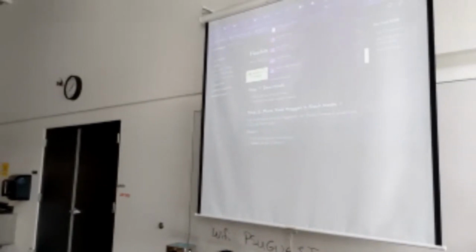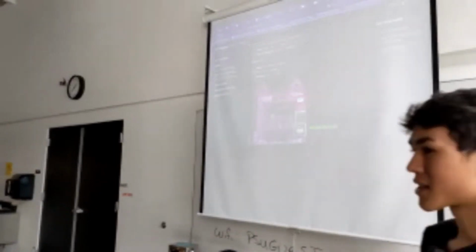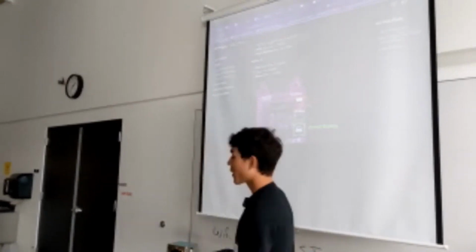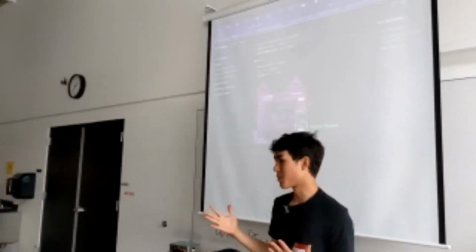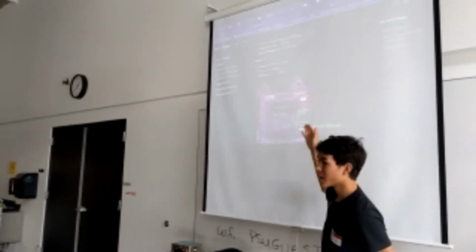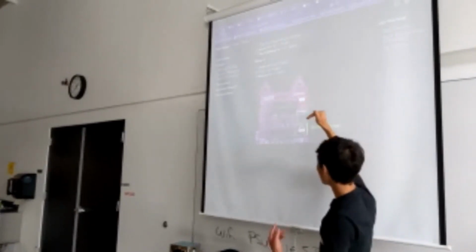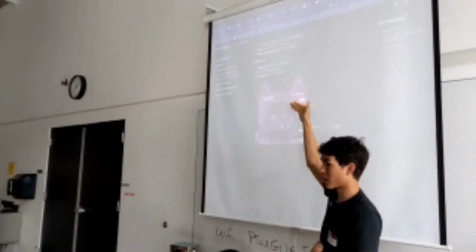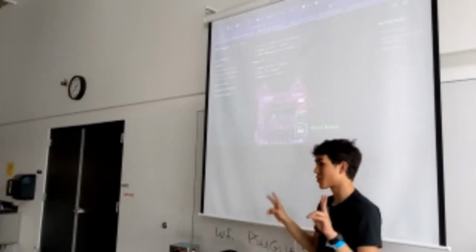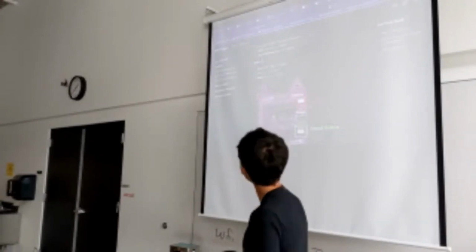So you've downloaded Chrome, you've downloaded the binary file. The next thing that you'll need to do is put your device into DFU mode, or device firmware upgrade. The way that you can do this is through a sequence of button presses. It's pretty simple. You'll notice that your Nugget has 2 buttons. It has a 0 button and a reset. The way that you'll place it into DFU mode is first you'll hold down 0 and keep holding it. You'll tap reset and release, and then you'll let go of 0. The 0 button is also equivalent to the boot button. So this basically puts it into a boot or device firmware upgrade mode. You can also see that documented here if you're having trouble.